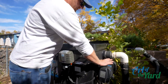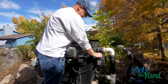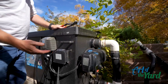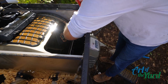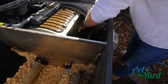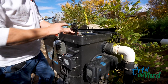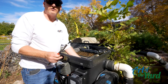If you've got a UV on the system, you want to remove that for the wintertime. The quartz glass sleeves inside all UV systems are really susceptible to freezing and breakage in the winter. Remove that entire system and get it inside somewhere it's not going to freeze, to keep it good for the following season. There are two union connection pieces — one on each side — and you completely disconnect those to pull the UV inside. There's an O-ring on both unions, so make sure to keep those inside with your system so you don't lose them come springtime.